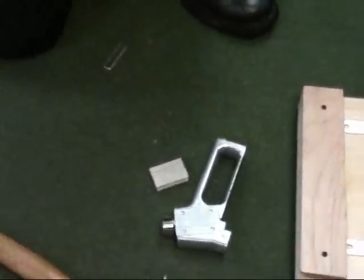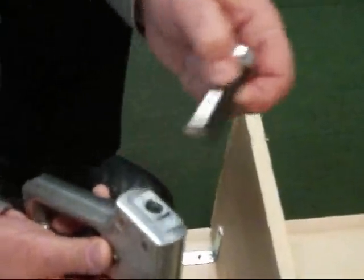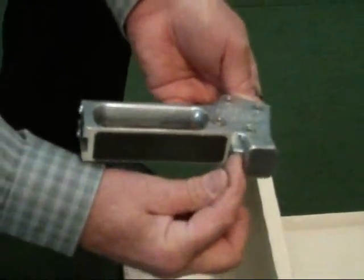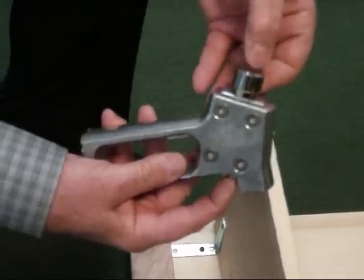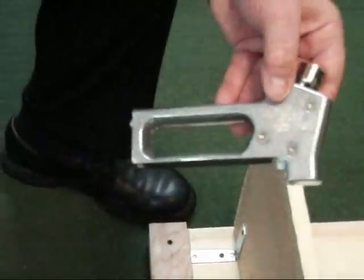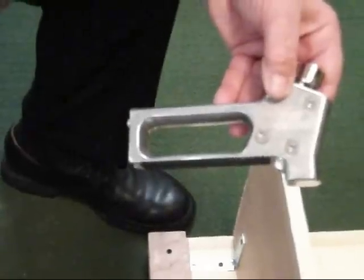Showing the components again — the drive point pulls out and slides right in. This rests on the floor and comes to the edge of the tongue, so all the force of the hammer drive is not directed onto the tongue, because this goes in at a 60 degree angle instead of the 45, which your normal stapler does.